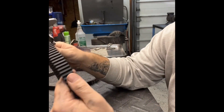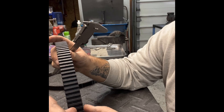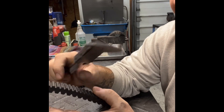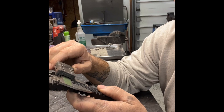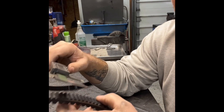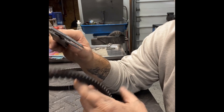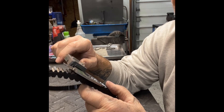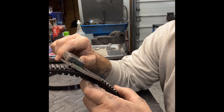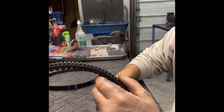The belt has a little bit of taper on the inside — it tapers down on the inside — and on the outside it tapers out. Right on the widest taper of the belt is where you're going to measure. Just take your calipers and right here I'm getting 0.826. Go a little farther around the belt — now I'm getting 0.817. Go a little farther — I'm getting 0.821. Go a little farther — another measurement, 0.819. Measuring in that many different positions is important.